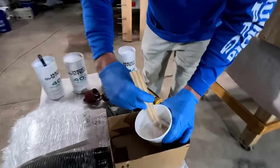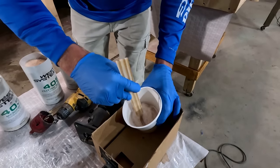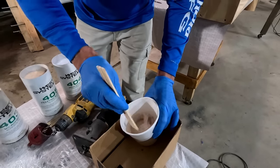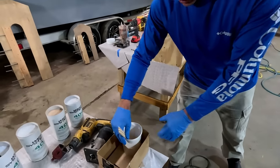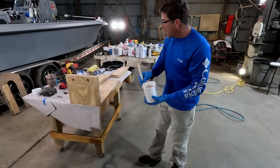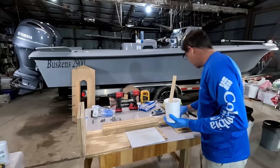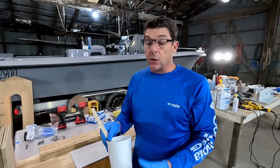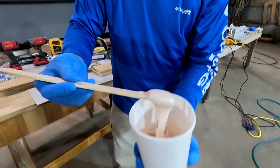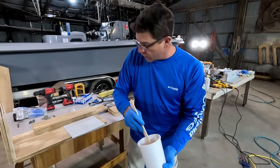It's fairly mild in my part of the country today — temperatures are falling, it's in the evening. The vacuum should capture any airborne material. With epoxies, unlike polyester resins where you add more or less catalyst, with epoxies you use different hardeners — usually a slow, medium, and fast. Today we're using a fast hardener because it is quite cool, and I think this will move along nicely. You could thicken that up more, but for today's purposes I'm pretty happy with that consistency. Some people like the consistency of creamy peanut butter.